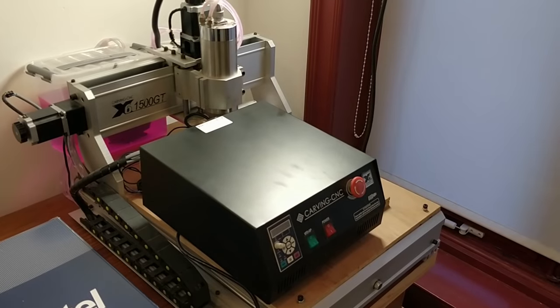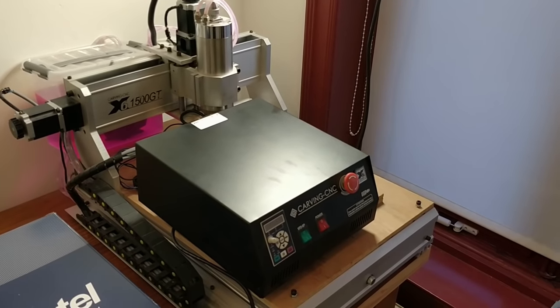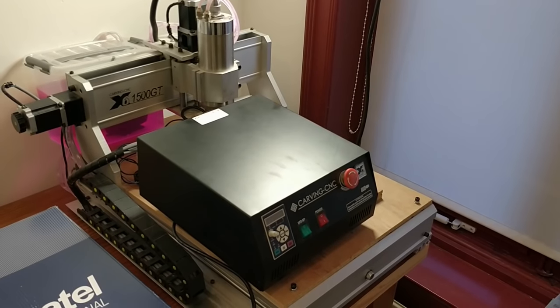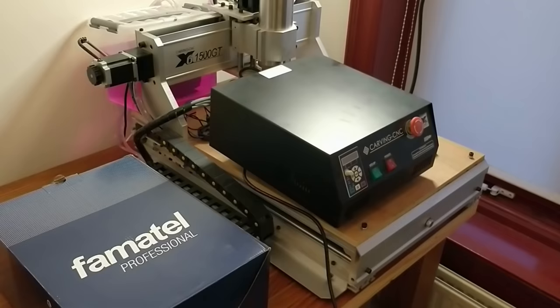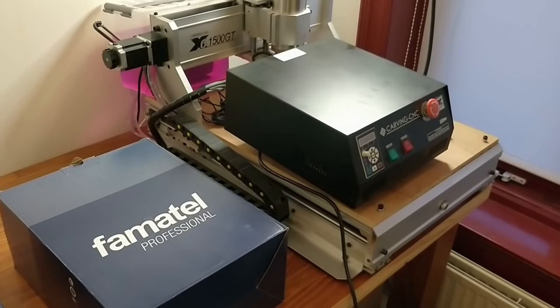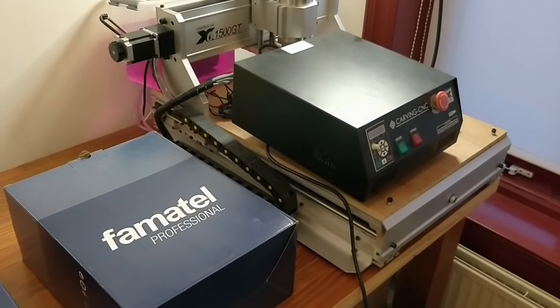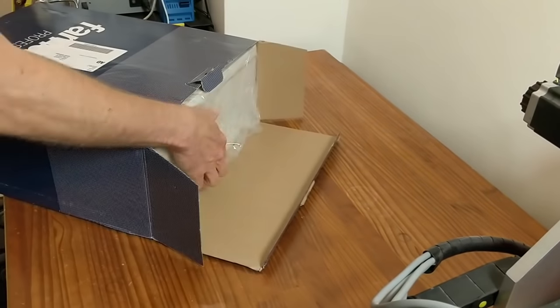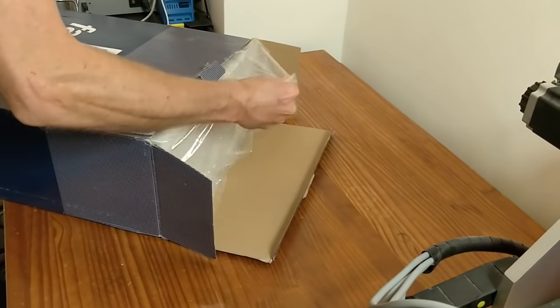The DDCS controller does not fit in the original control box, so I had to purchase a new enclosure. At first I purchased a plastic enclosure that was only slightly larger than the original controller. However, after trying to fit the components in the new box, it quickly became apparent that it's better not to skimp on the size of your enclosure. A larger one makes your life a lot easier when assembling everything.